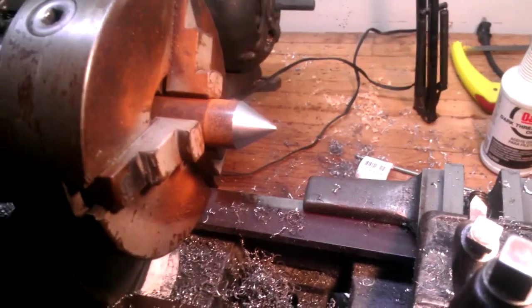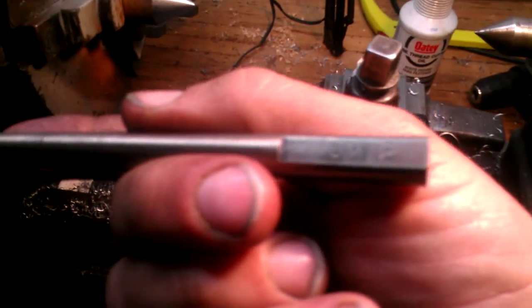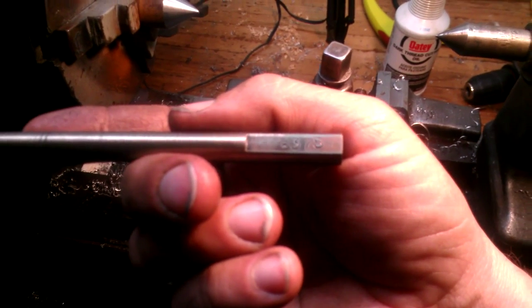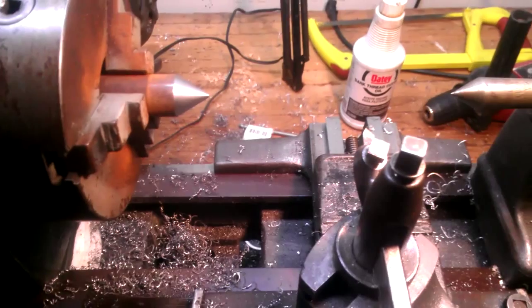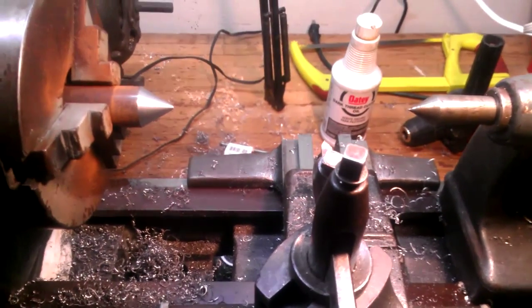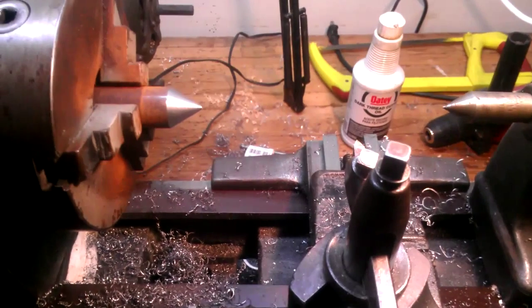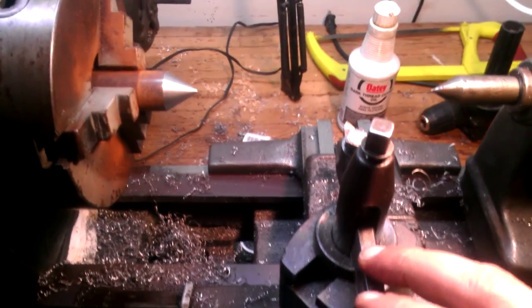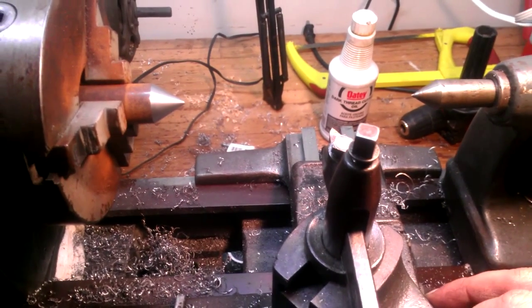So I'm one step closer to being able to manufacture my new dials. I'll use this dog to drive my 3/8ths mandrel here — even stamped at 375. That'll go in here like this. I'll taper on — or drive on — my dial blank. Then I plan to face both sides and turn the diameter, and then I can scribe the lines on it all without taking it off the lathe. I'll just have to change my tool. I want to get a quick-change setup so I can just drop in my tools and do each step.